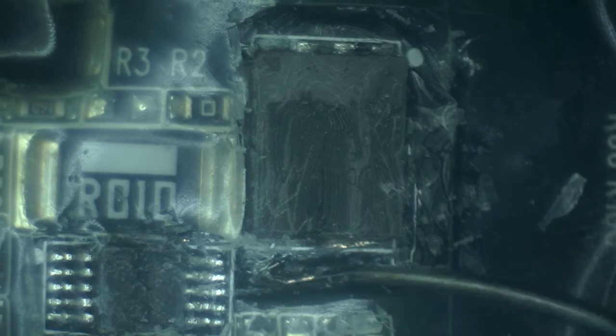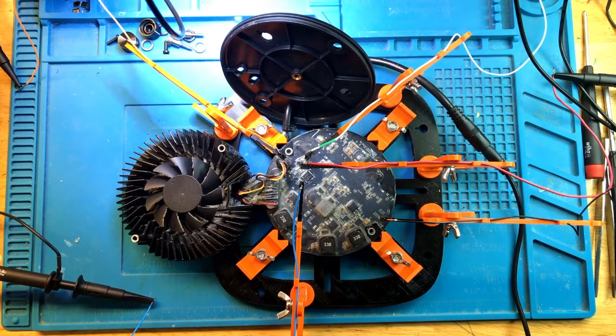So what I'm going to do now, instead of guessing, as I don't really like those guessing games, is hook this light to a rig where I will probe the voltages throughout this connection and see if what I observe may actually make sense, or if it would explain the reason why the light shuts off. So to find out what actually is going on with the power up and then shut off, I have this test rig that has many different probes going down to the control circuit and connecting to the little pins there. Paired with an oscilloscope, we should be able to record voltages, drops in voltages, and the history of voltages across different pins, and then compare that to what we see in the data sheet for this control logic and see if we can figure out the problem. So let's rock and roll.